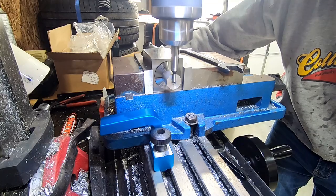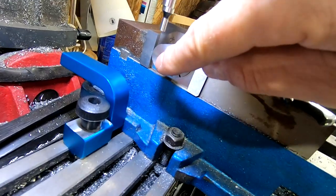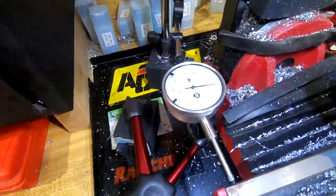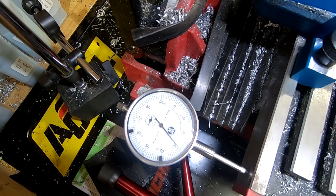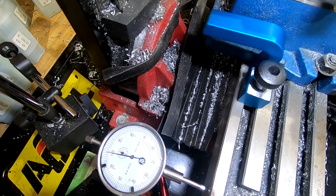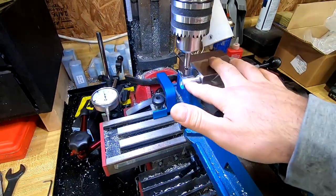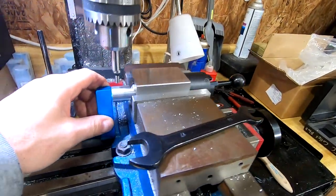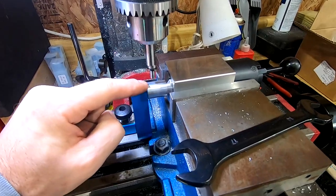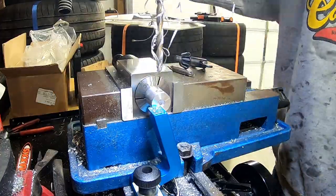I went ahead and edge found the backside. The diameter is about 742 thousandths — half of that is 371 thousandths, plus 100 for the thickness of the edge finder, so we need to go in a total of 471 thousandths. I'll go in one, two, three, four — come around to 71. My slides are locked, so I'm now ready to drill. As long as all of them butt up to this little edge finder, I'll drill the hole in the same spot on all of them.